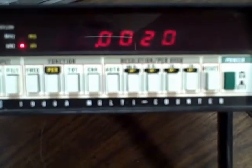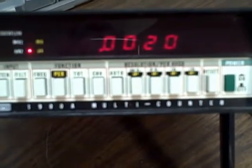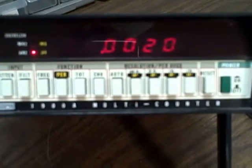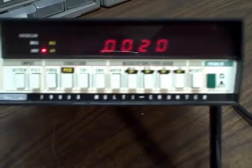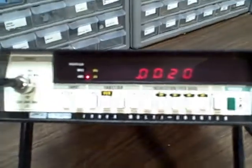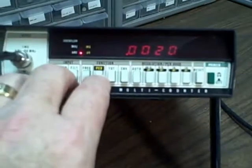The upper end is about 100 MHz, because you can't read higher than that — it goes to overflow. So you have a 2 Hz to 100 MHz range, with a rated range of 5 Hz to 80 MHz, high input impedance, brand-new looks, in calibration, functioning beautifully.